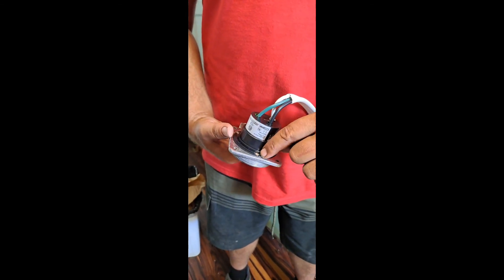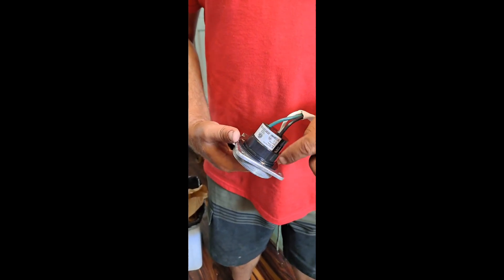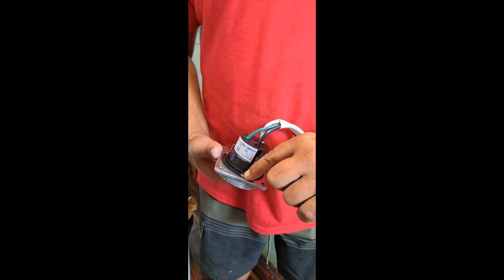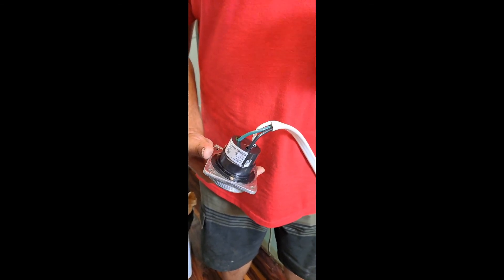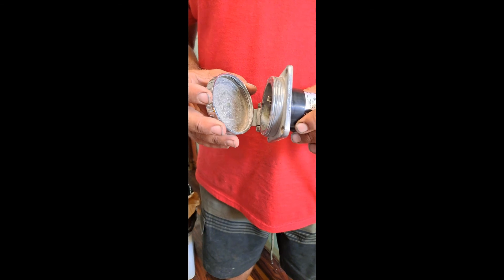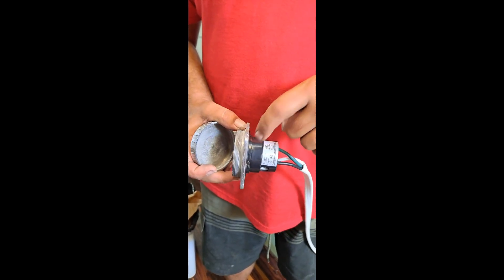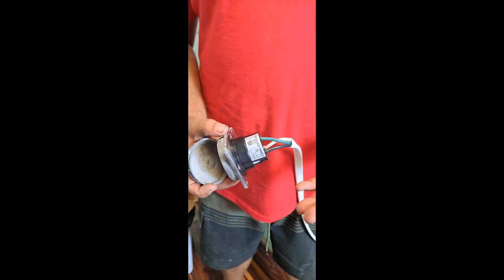You'll have to take a slightly bigger drill bit, because this style comes with really tiny screws meant for the RV, and the heavy-duty housing has larger screws. So you'll have to drill out the inside of where the screws go a little bit, but they follow the same exact hole pattern. West Marine has these for $200 and you have to get the whole assembly, or it's $37.99 to $42 for just the replacement piece — but $50 got me the whole unit for the RV and it was interchangeable.